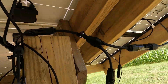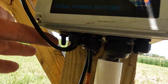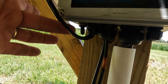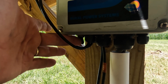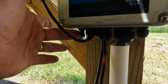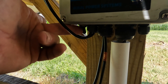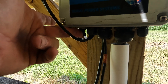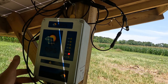Here's another trick if you have the RPS solar: there's a switch underneath — a little toggle switch. Back is battery, center is off, and to the front is solar. If you want more power during the day when the sun's fully on your panels, put that switch to solar temporarily while you use it, then flip it back to battery so it recharges the batteries later when you're not heavily using it.